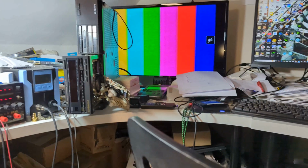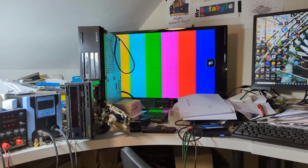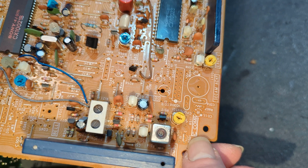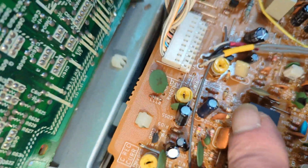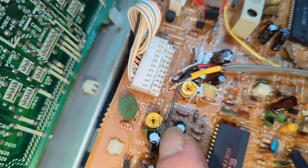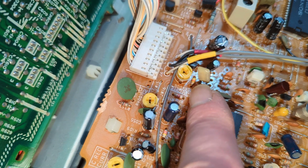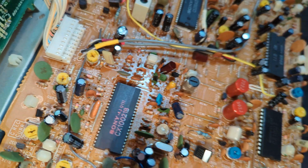I've had to very, very slightly adjust the signal, the C comb, and there was something else that was ever so slightly out. Carrier balance. So slightest tweak. Oh, and also I mean, basically I went through the lot in the end. AFC I think was fine, but the offset was slightly out, I think I've got that right.